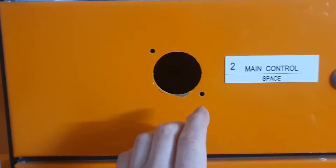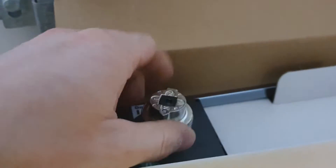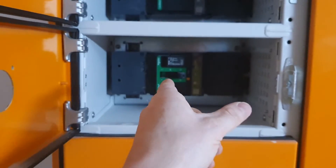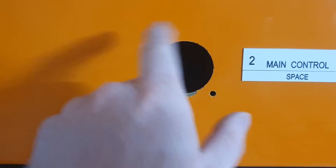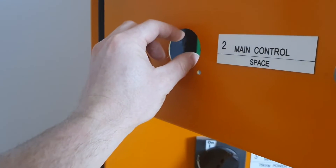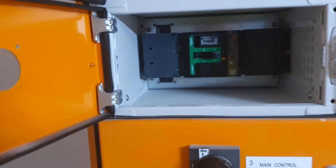When you're doing this, if you have to punch these holes yourself, the best way is to install this unit and then set up a laser tripod shooting through and hitting directly in the hole here. Then shut the door and your laser is going to be in the perfect spot so you can cut your hole. There's quite a big cover plate that goes over the top so there's a bit of play - you don't have to be perfect - but if you use the laser you're going to be spot on every time. And that's what it looks like with that cover plate off.